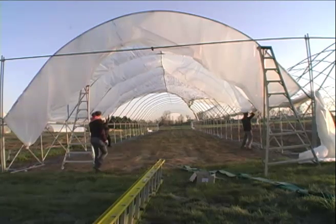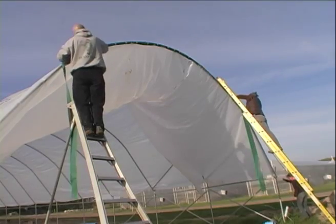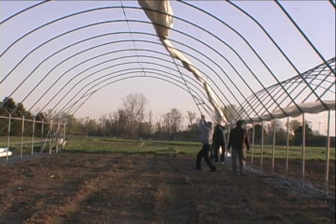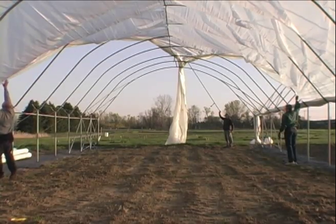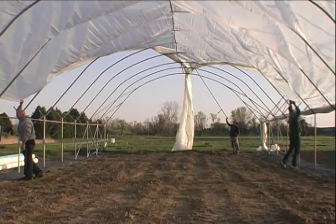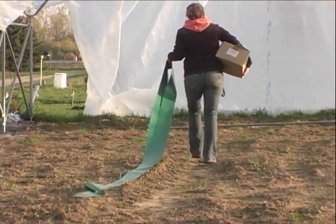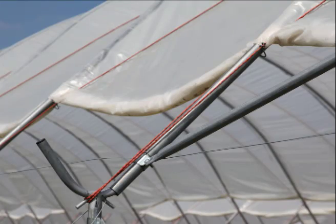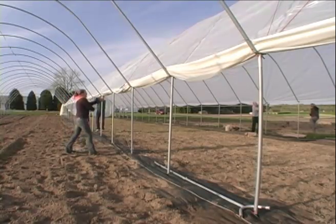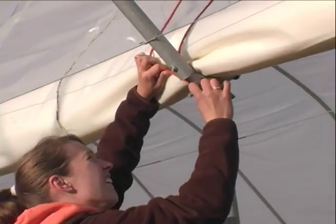The poly is secured to the end hoop with pipe clamps, using a piece of thick fabric strapping between the poly and the pipe clamp. Once secured, the edges are pulled down to the trough on each side of the tunnel, working from the secured end to the far end. To pull the slack from the poly, workers on opposite sides can work together to billow the poly up and down while pulling the excess poly down and toward the far end — try to get the plastic as tight as you can. The poly is then attached to the far end hoop in the same manner. Finally, the poly is secured in place with roping immediately so that wind does not blow the plastic off. The ropes are secured to the leg posts and pulled back and forth across the top of the tunnel, first hand-tightened and later re-tightened with a pulling device.